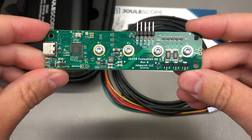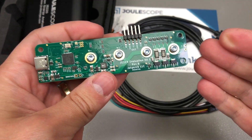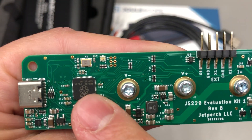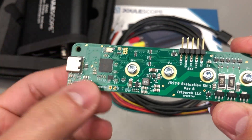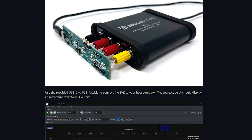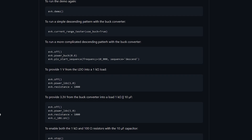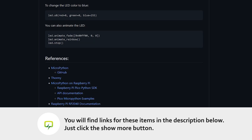Optionally you can also purchase this evaluation kit, which retails for something like $99. It basically contains a set of resistors and capacitors which are switched with the help of MOSFETs to generate different dynamic loads. These are under the control of a Raspberry Pi Pico microcontroller, and given the current global situation it makes a lot of sense to use one of these - they are affordable and available. This EVK can run MicroPython, it's got its own GitHub repository, it's open source with its own documentation, and you can control it over USB to run different voltages and activate different loads on the output. I won't go into too much detail on the EVK itself - I'll provide links in the description so you can check it out.